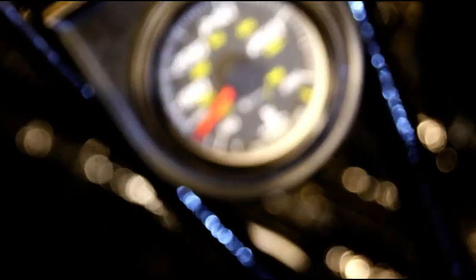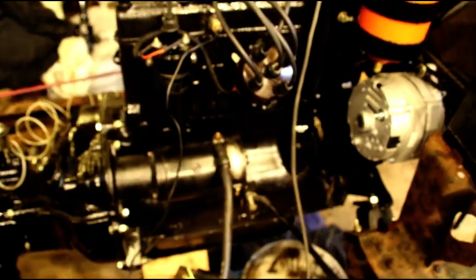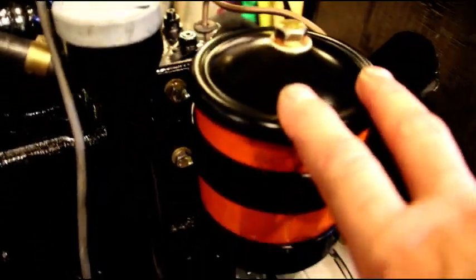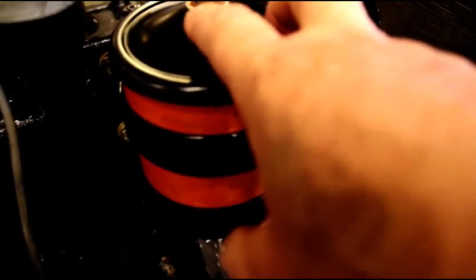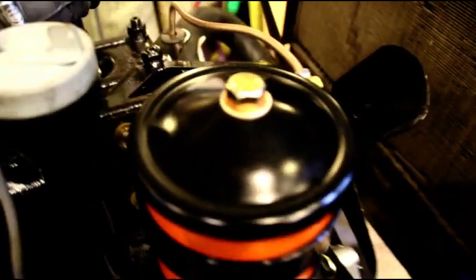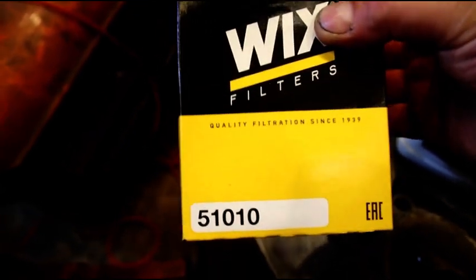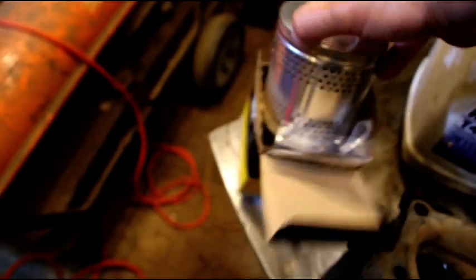You can see this guy is cooling off — about 150°F. I'll grab an oil filter and show you what you should be using. Mark, when you take your cover off and pull your filter out, make sure you tighten that nut enough — there's full oil pressure in this canister, so you're going to have 40 to 50 pounds in there. Don't let it leak. Make sure you tighten that nut well — don't strip it, don't put gorilla torque on it, but just make sure you fire up the engine and check that it's not leaking. What I use for all canister filters is Wix — I use Wix filters on everything.